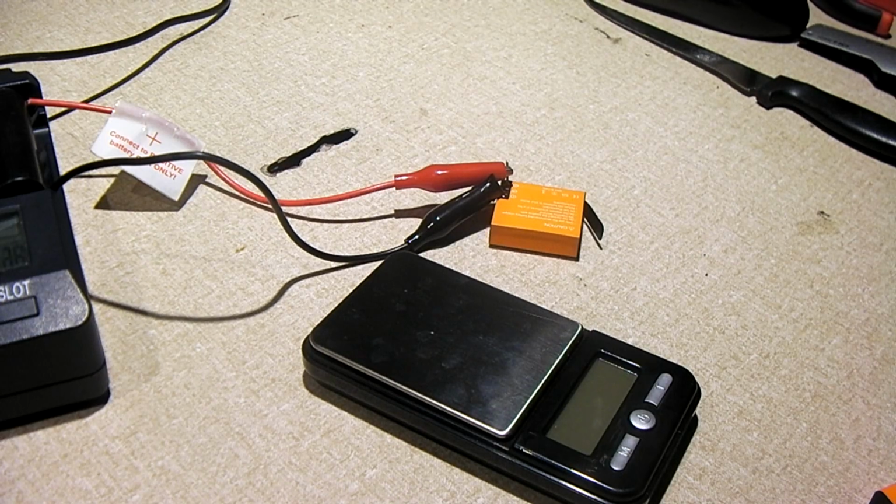For example, my Midland XTC 280, I think it is, that other old action camera I have, all the DXG cameras that I have, and I'm thinking this as well, seem to consider a lithium-ion battery to be fully discharged, or at least the shutdown voltage to be at about 3.6, about 3.5 to 3.7 volts. So, not making full use of the battery's capacity.